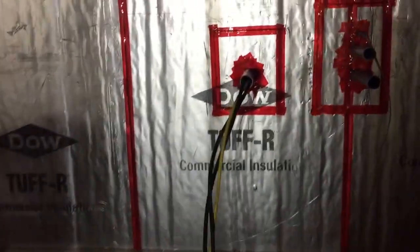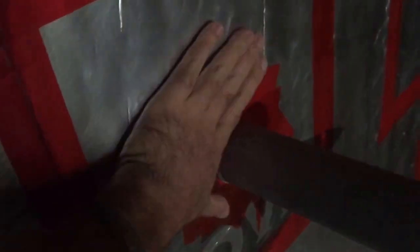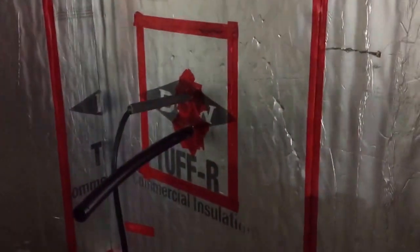So underneath the electrical penetrations, plumbing penetrations, the hole itself, the hole that goes through the concrete, was filled up with silicone. And then there was a rubber gasket that slipped over here that was stuck to the wall with a special Tescon primer, and then Tescon tape holding the seal on the wall. And then, as you can see, after the foam, there's even more of this tape. Totally airtight. That's where the water comes in. Same idea. Silicone, gaskets, super airtight.